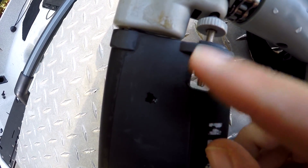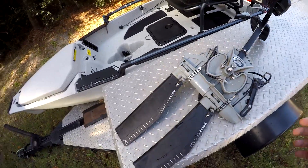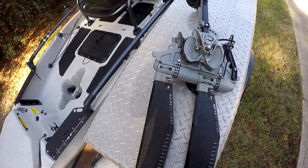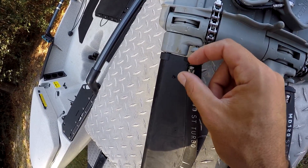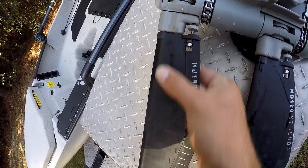When you hit a stump and the fins bend and you need to make a correction, you couldn't do it easily on the water with the old design because it had two nuts you don't want to be dealing with. What Hobie did now is go back to the old V2 drive design — there's just a pin that runs perpendicular to the shaft with a split ring on one side. Take off the split ring, the pin slides out, the fin slides down. That design lets you make a repair on the water with just a pair of needle nose pliers — which you'll have because you're ripping hooks out of big bass.